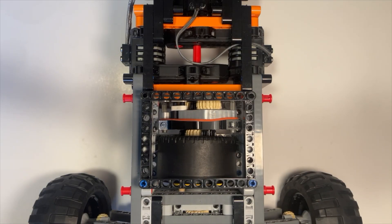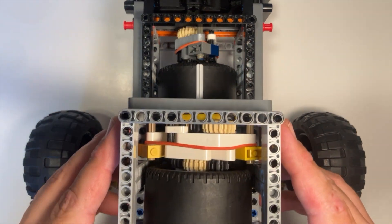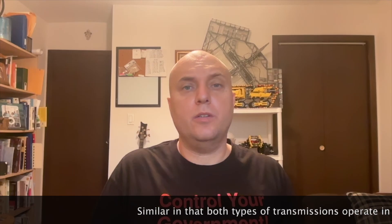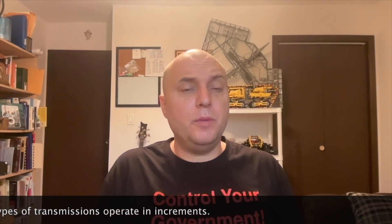Here's another thing I love about this transmission related to its efficiency: it is so simple that in a real-world application, it would be rather easy and cheap to put several of them in a series. Such an arrangement would substantially increase the efficiency of the transmission group during transition by creating more increments at which the group would remain near 100% efficiency. But if we did put several of these in a series, that would be very similar to a standard automatic transmission. Would that be worth it? Would that still be considered a CVT? I really don't know — I'm looking forward to reading about it in your comments. Thank you for watching.